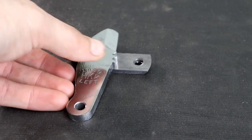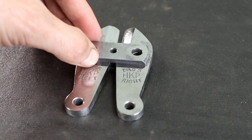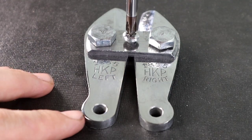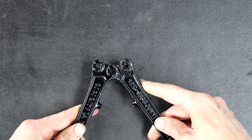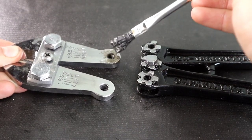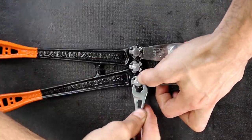We'll start the assembly with the bottom strap, followed by the left and the right jaws. Attach the top strap with the two jaw bolts, but leave them loose for the final adjustments. Reattach the lock plate screw — where's the lock plate? — and then move over to the handles. I'm putting some assembly grease on the pivot contact points, sliding the jaws into the slots, and lining up the connecting bolt holes. Place the locking washers onto the handle and insert the bolts, waiting until all three bolts are threaded on before tightening them down.